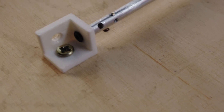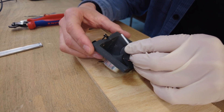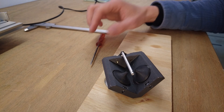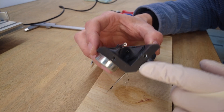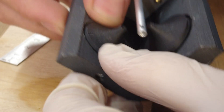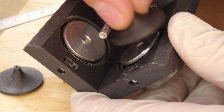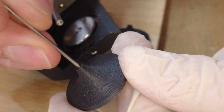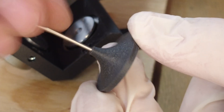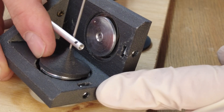The end result looks quite nice. Let's now connect the tube to the rest of the head. First we screw the end of the tube onto the cantilever spring. The driver caps must sit exactly centered on the drivers. The 1.2 mm wire is test fitted into a driver cap and placed back onto the driver to measure the correct wire length.